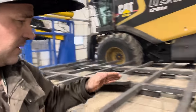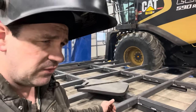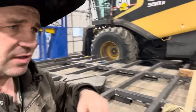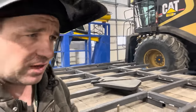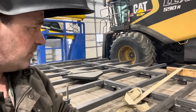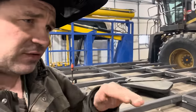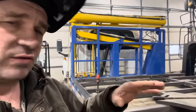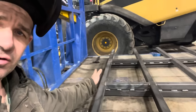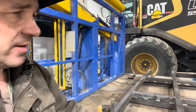As the plans show me, I'm working on 16-inch joists, and actually the plans called for 24, but I thought that was too much. So I shortened it down to 16 inches, and I ran a 1/4-inch plate on the bottom all the way along just to keep everything straight and true and to take the flex out of the whole assembly. With all my weld sequence, I've been able to keep this thing perfectly straight. I paid a lot of attention to welding, tacking, and making sure I weld so the thing doesn't end up like a bow. Except for the front here, I screwed up. I welded wrong, so I had to do some grinding to pull things straight and then re-weld things up. I'll just take the grinder to that to clean it up a little bit.